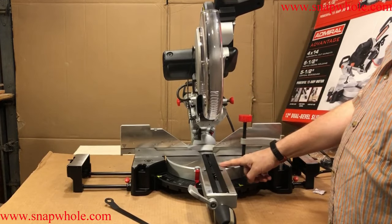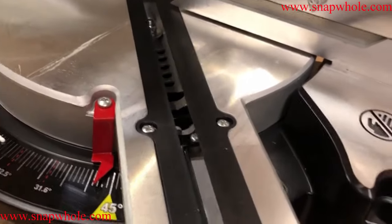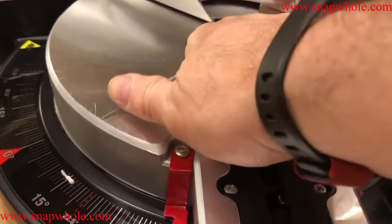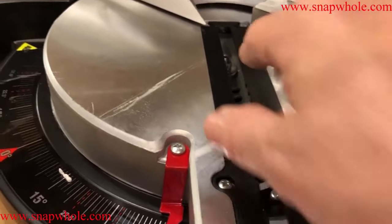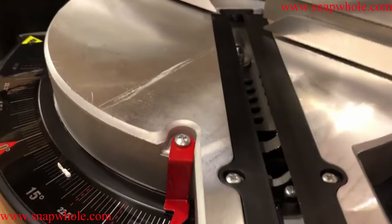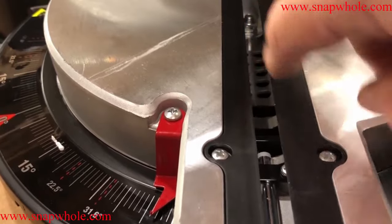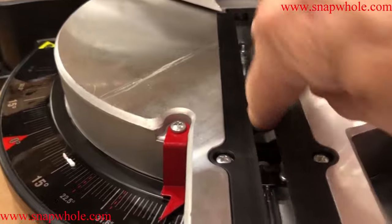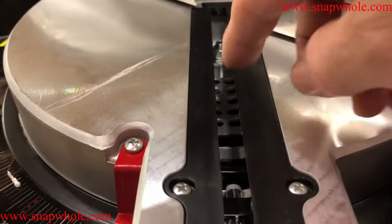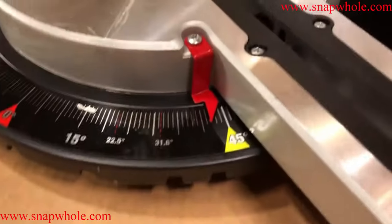Using the Chicago Electric in service, I've noticed that this is a very wide zero clearance — actually it's not zero clearance. I use a piece of plywood over that a lot of the time to get zero clearance. The problem is thin pieces fall down in there, and it's designed to hold those pieces in there so it will fill up and is difficult to clean out. You have to take off this throat to get in there. I would rather have it fall all the way through, but if you tie it to the table you'd have to take the saw off to get to it.